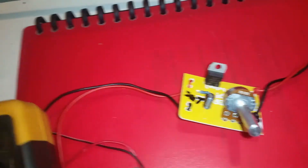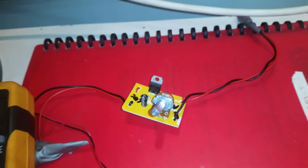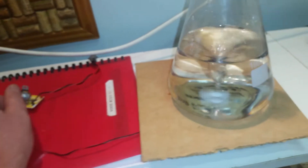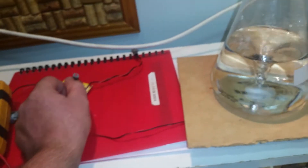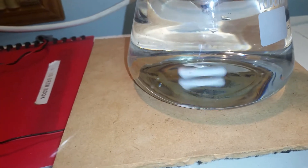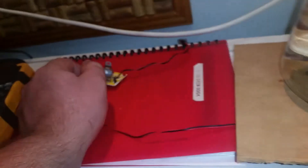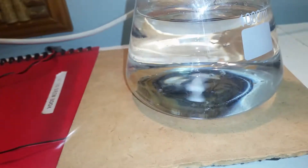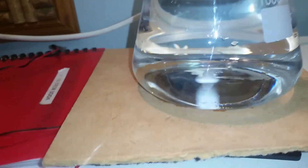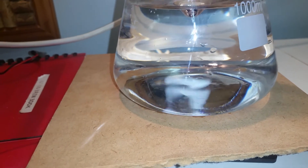They're not really necessary — I put them in there anyway, it's just an old habit. If you're using digital circuitry they're very good for filtering, but for a speed control fan circuit they're not really necessary. Let's see how low we can go — I'm just going to turn the trim pot here, slowing it right down now.